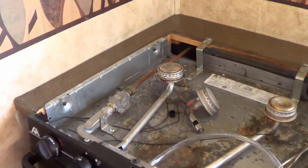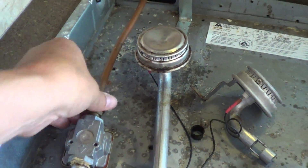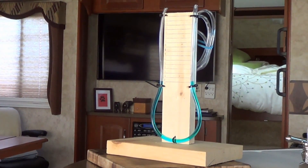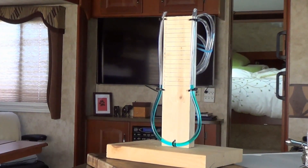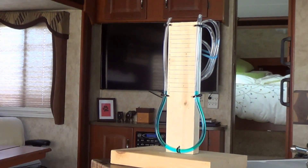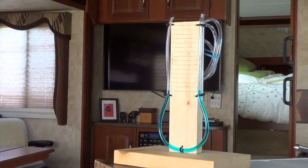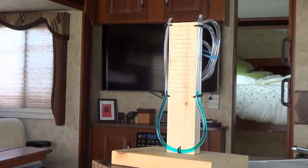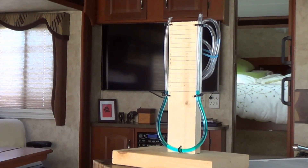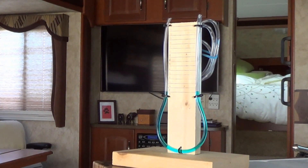I saw online that one guy would open this connection and then with wrenches insert a manometer in-line with that. I'm not advocating this as a replacement for a proper certified check of your propane system by someone who really knows what they're doing with the proper equipment. But I think it is a cheap, dirty way of checking for leaks — and I'm liking it, I'm going to use it. I'll leave a link in the description — I came across a blog post by a guy called RV Doctor about what the pros do as far as LP gas. It's quite an interesting read and informative for RV owners to read about what's going on with their LP gas system. Anyway, until next time, this is Ray from loveyourrv.com. Thanks again for watching, folks. Cheers.